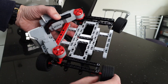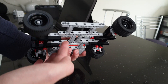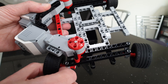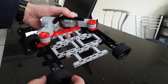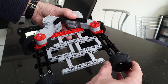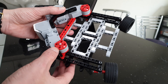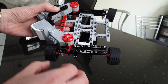Let's have a look at how this is put together, ignoring the motors for now. We've got our wheels and just a structure here for the camera to sit on. The wheels, you can turn them like that, and you can hear the motor is providing some of that resistance. Without it, these wheels just flop all over the place and were quite difficult to set to the position you wanted. If you want to curve it inwards so it follows on a curve like that, keeping those wheels aligned was difficult without the motors. So I've got the motors there purely for the resistance, and when you've set where you want the wheels to go, it generally stays where it's supposed to.